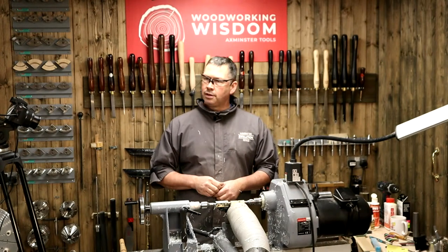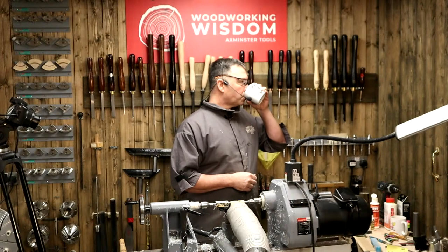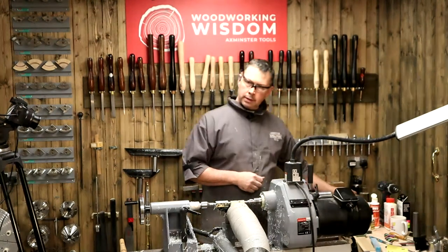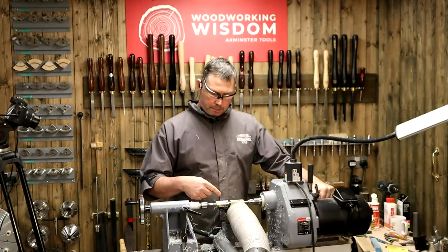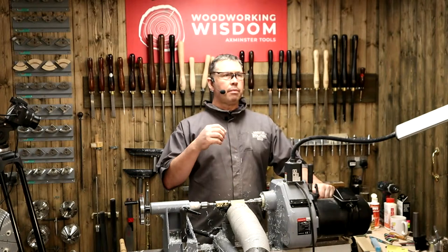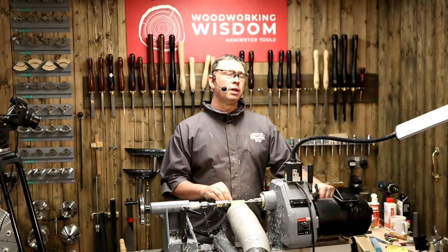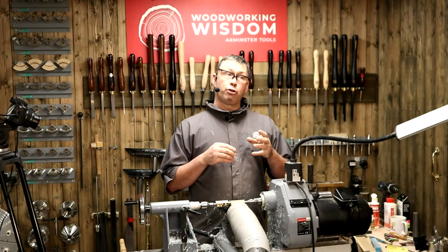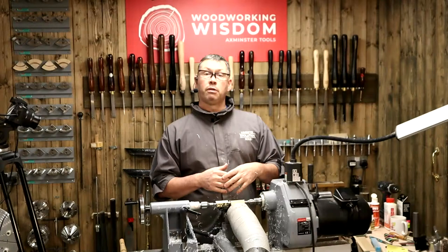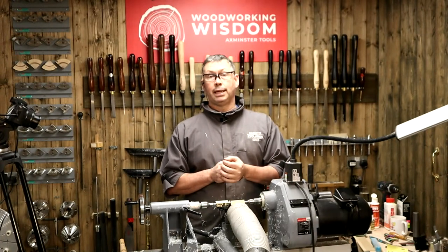And Steve's asking, whenever he sands, he gets vertical scratches as you're looking at the blank on the lathe all along. Any tips? So the rotary scratches, I'm guessing. If it's pens you're talking about, you're probably starting too coarse, not going through enough grades, and maybe not staying on those grades long enough. All three of those reasons will cause those scratches to remain until the end.